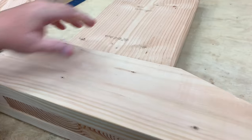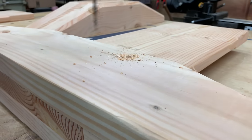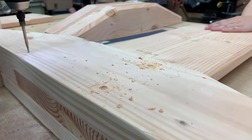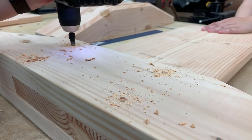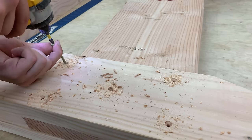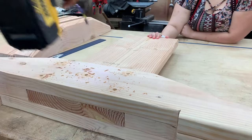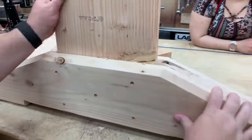That's done, and I have inserted the leg into the foot piece. The leg is actually three-quarters of an inch off the ground because of my notch. So I'm going to put five screws in here — I want maximum holding strength and I don't want this to wiggle. This has got to carry the whole tabletop and I know someone's going to sit on the edge, so I've spaced five screws equally around the perimeter. I'm going to flip it over and put five screws on the other side as well.